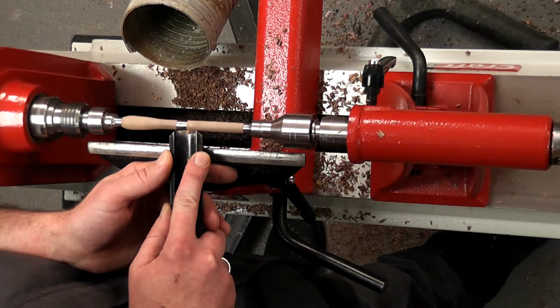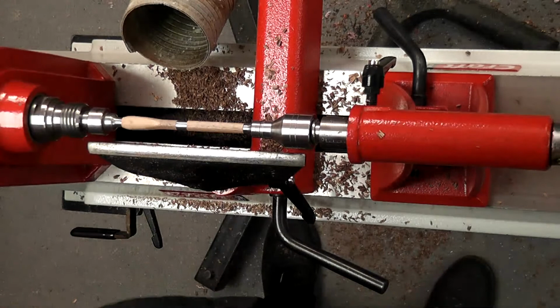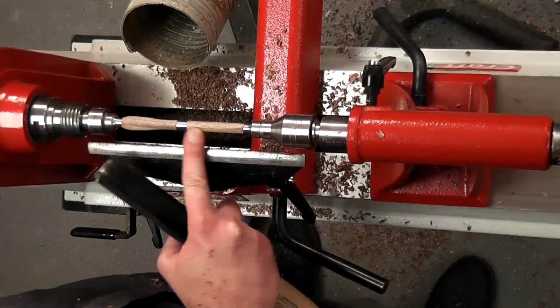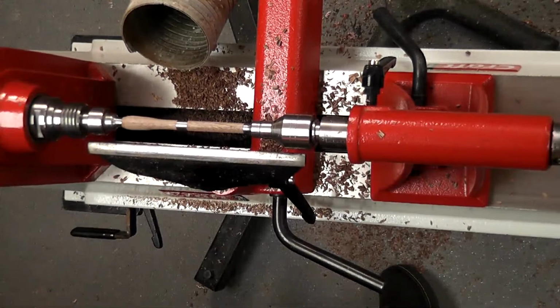This is a bevel rubbing kind of finishing cut. And let's just have a little look-see. Probably not obvious on camera. You can see this one's just slightly more reflective than this one, where we've used that kind of finishing cut on it. Okay. If you wanted to practice with your skew, this is a great time to do it.